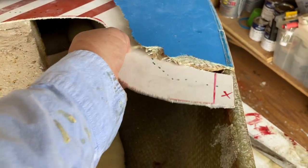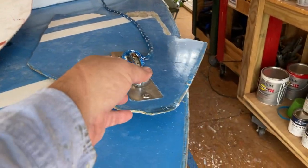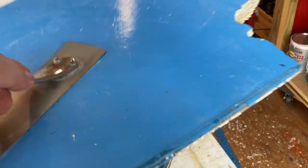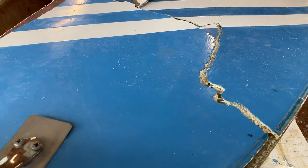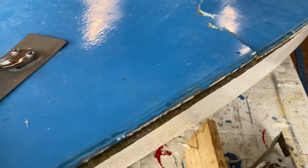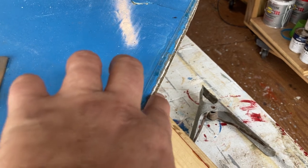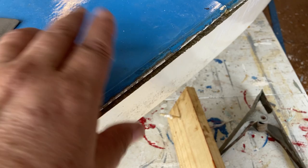It's going to be epoxied in. It's going to have to go in all at one time along with this bow piece, because we've been able to slide this bow piece back into place. And Skipper takes her rubber mallet, taps it, gets it all lined up, gets the edges aligned, thickened epoxy, fiberglass cloth strip in the seam, and once again clamp it all together.